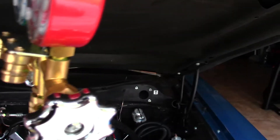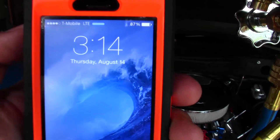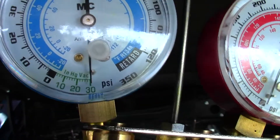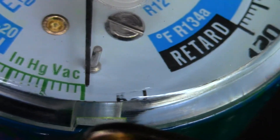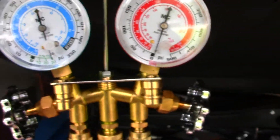Right now it is 3:14, so I'll come back right around 3:45, 4 o'clock. I'm going to leave the pump on and pull as much vacuum as possible on this system. Looking at that needle, I think I'm just about bottoming out — not quite though. Got a solid 30 inches of mercury on it.